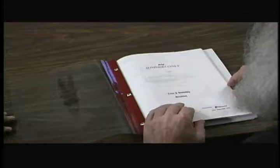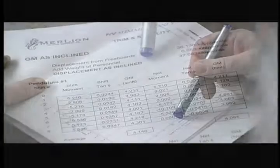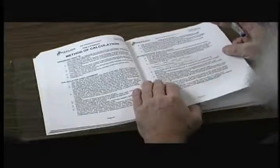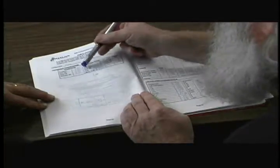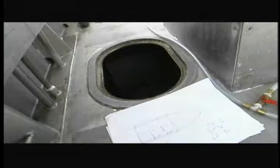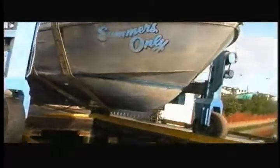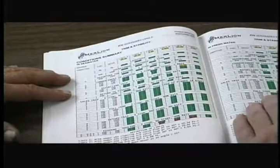The results obtained from the inclining experiment are then developed and recorded in a stability book. A stability book will document your vessel's GM. This distance is a critical factor in determining a vessel's ability to right itself when heeled by external forces, and is also the basis for developing stability characteristics in different conditions of load and identifying operational limitations. There are two downflooding points critical to this vessel: the hatch openings in the main deck. If those hatches are open, this boat will not meet Transport Canada stability criteria in virtually every condition of loading.